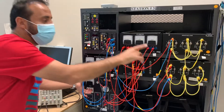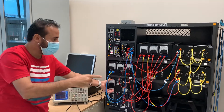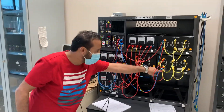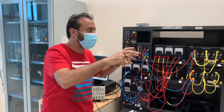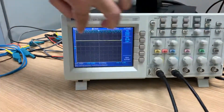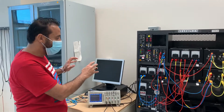I need to use two resistive boxes for this connection because the voltage will be high. Turning on, you can see the voltage is around 250 V. I have to turn off because the load is insufficient — the rated value for this resistive box is 120 V. To connect the full-wave configuration, I need to connect two resistive boxes in series. Let me bring the voltage down — it's very high — I'll stop it and turn off.